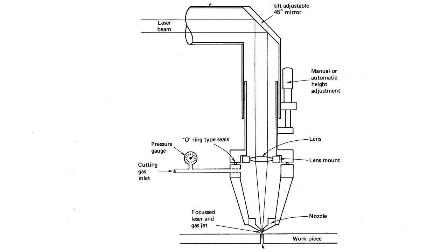Here we can see a diagram of the laser cutting head itself. The beam comes in at the top left-hand side from the laser — it is parallel — and it turns through 90 degrees via a 45-degree mirror, then passes down the center tube through a focusing lens. That lens converges the beam down to a very narrow neck, probably about the thickness of a human hair. Coming into the nozzle from the left-hand side is something called cutting gas. In normal lasers that could be oxygen, high-pressure nitrogen, or air, depending on what material you're cutting. In this instance we're using air because we're only cutting very thin, light, easy-to-cut materials.